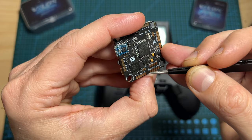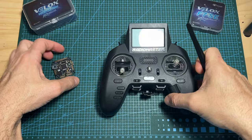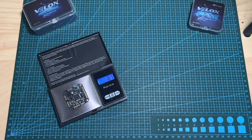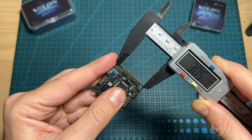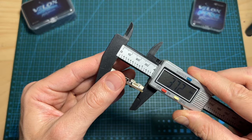Using these two pads you'll be able to enable pit mode. When pit mode is enabled, you will be able to control the VTX output power — meaning you can turn it off — and control it using an auxiliary switch on your radio controller after configuring the flight controller on Betaflight. In terms of weight and dimensions, the flight controller weighs 8.7 grams, uses M4 30.5×30.5mm mounting holes reduced to M3 using the provided rubber grommets, and its outer dimensions are 37.2×36.7×6 millimeters.